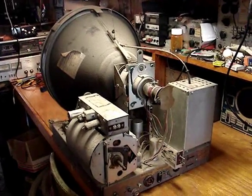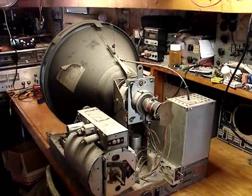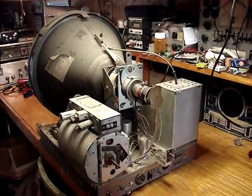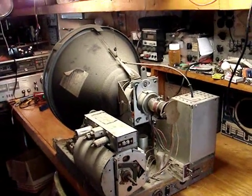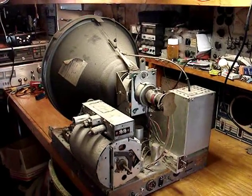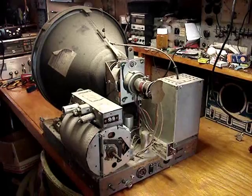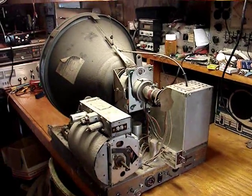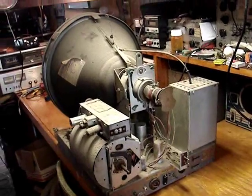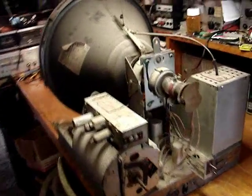Here is the chassis removed from my Zenith 1951 Giant Circle Cobramatic console. I figure that it's about time that I pull this out and look into recapping and replacing low or out of spec resistors in the chassis to try to get this thing working again.